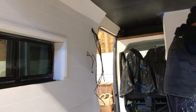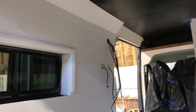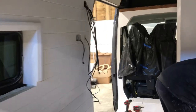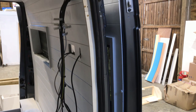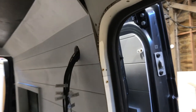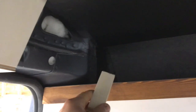I'm currently working on the area above the sliding door, using a piece of plywood and a kerf-cutting technique to bring the plywood around the curve. You can see the screws there — they'll get hidden. The kerf cut is this piece here, and I'll box in this area so the pillar is hidden.